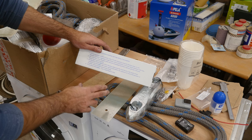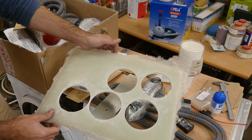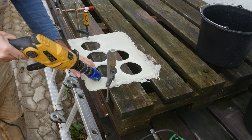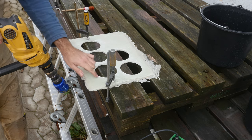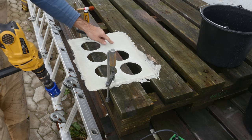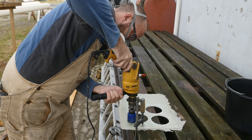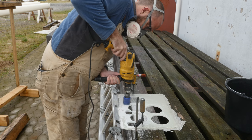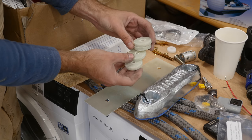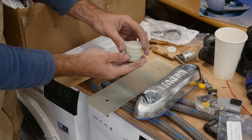The instructions call for a wooden backing pad on the inside of the hull, but I can do better than that. I've got this little bit of fiberglass left over from some other backing pads. I don't need these backing plates to be super big so I think I might be able to get them out of these little areas. This is gonna cause a lot of fiberglass dust. I would hardly call these backing pads — it's more like oversized fiberglass washers — but for this application they should be perfectly fine.